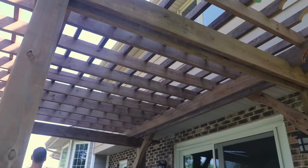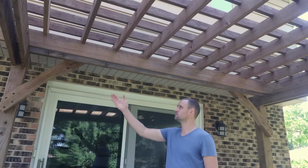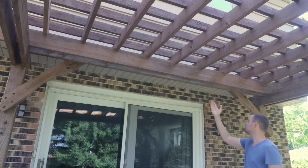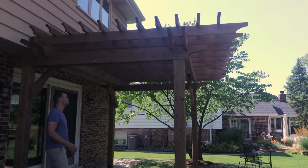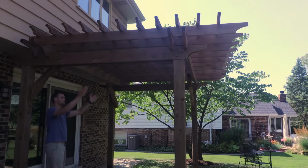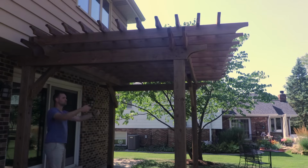We have decided that we want the shade to open side to side and must now measure the opening the shade will span. The first measurement is for the width of the shade fabric, which is length A and B on the measurement sheet. The second measurement is for the length of the track, which is length C and D. You will also have to decide which way you want the shade to drain. In this case, we are sloping the shade away from the house to drain any accumulated rainwater.